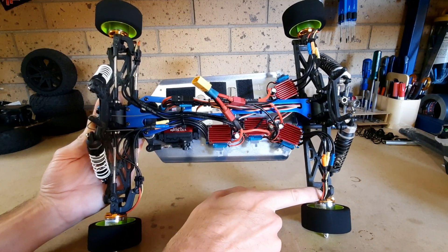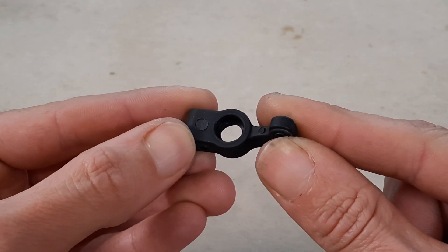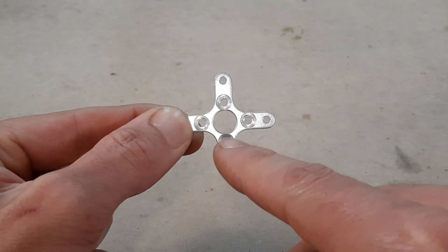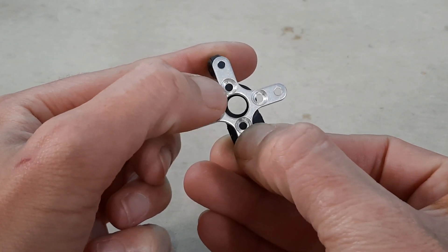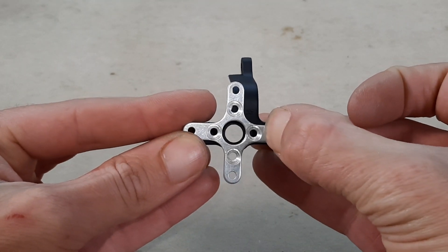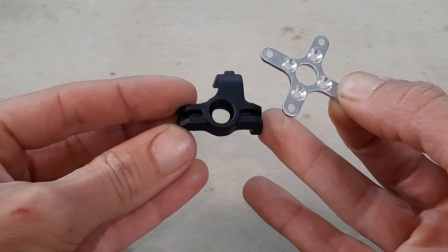The main reason I went with VRX in the first place was because of the hubs. They're large enough that you can actually drill the two main mounting points for these motors to mount on. The rear VRX hubs were quite easy to drill or to work with because there was a molding circle on the backside. All I've done is drilled a hole directly in the center of that with a three millimeter drill bit. Then I got one of these motor mounts — these two holes here are closer together than this one and this one. So using the two closer together holes, once it's all lined up, mount this down and drill your top hole. That's the rear hubs done, but the front hubs are a little bit different. You will probably have to get this mount and, using the closer together holes, mount that to the hub itself with a nut and bolt, and then drill your holes. As long as they're lined up center, it should be fine. They don't have to be exact — mine aren't perfect and it seems to work fine.